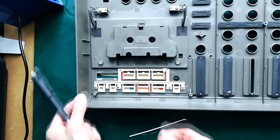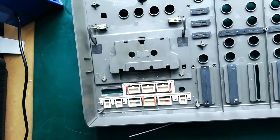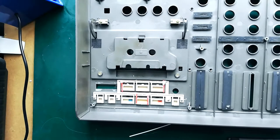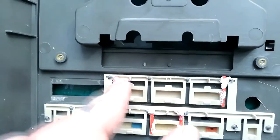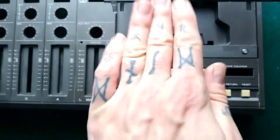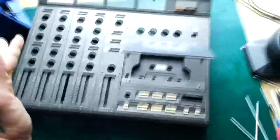That's going to work — I might file that down. This is not exemplary spin welding here folks, I've done it better on many other occasions, but at least you know I'm really filming this live. I've snipped the lumps of plastic in a couple of places where I think they would interfere with the switches beneath. Obviously this looks like hell from inside, but when you turn it over — I'd be satisfied, and I know from experience that's going to be fine once I reassemble this.